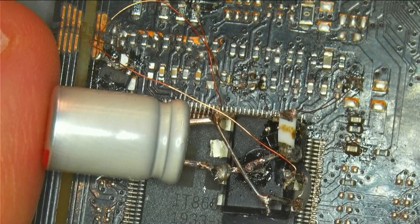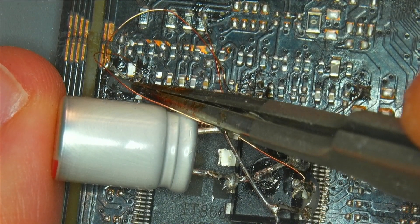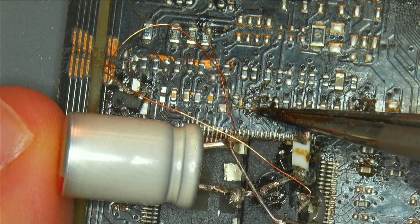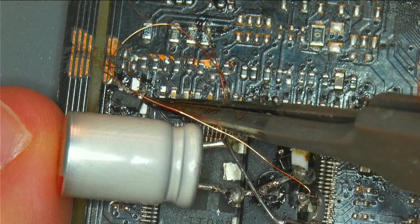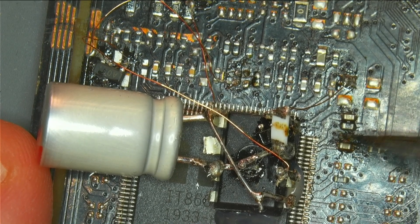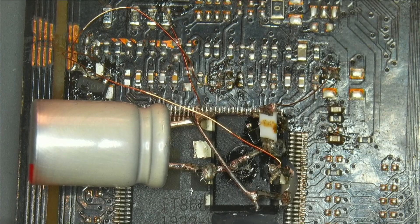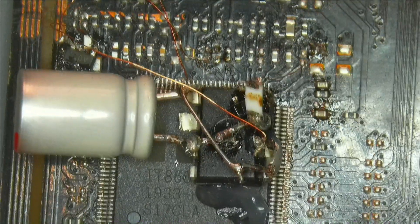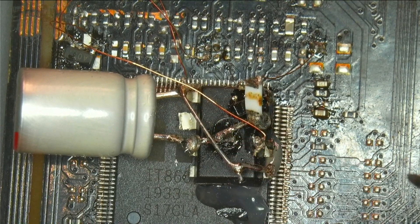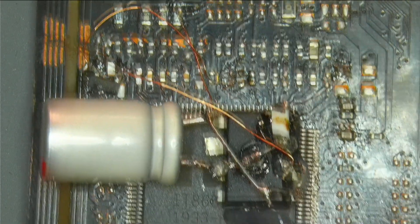You can see one wire going from the output of the 555 timer to the gate of the N-channel MOSFET, another wire for 5 volts as the supply voltage, another wire as the output of the N-channel MOSFET going to the target pad, and the fourth wire is ground. This board is working and fully functional, but it looks awful, could never be sold to anyone. It's quite tall, causing problems plugging in a PCIe card nearby, and held together with only flimsy wires and a little hot glue.